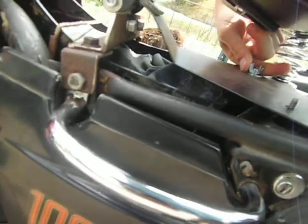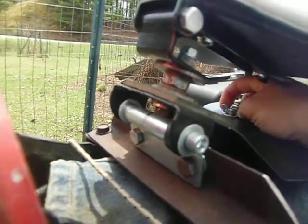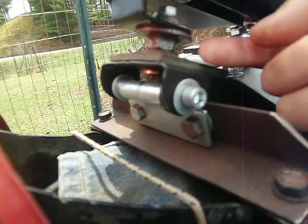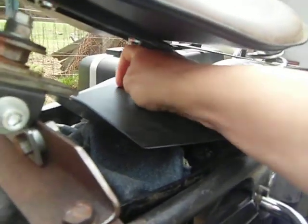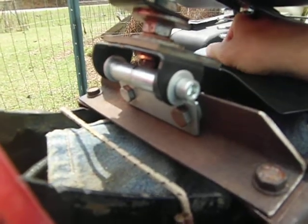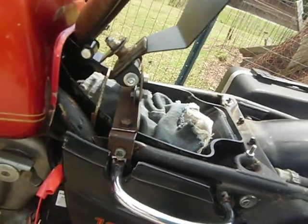Overall, it's really about getting the dynamic balance right on this. You want to get that bolt head underneath here all the way forward — there's a slot on the base plate — so that when you finish lifting the seat, that bolt head is actually resting right on the hinge. There are just all kinds of little details; it's not going to get done in an afternoon.